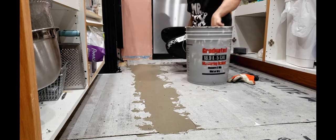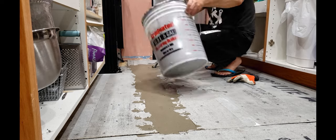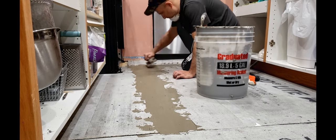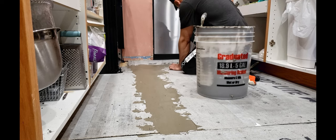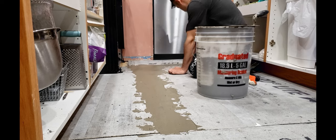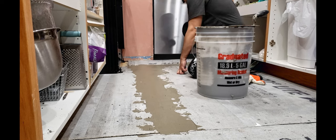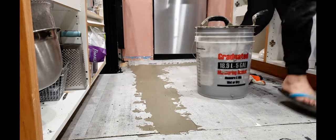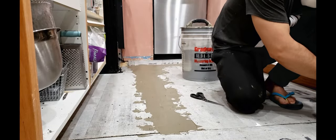Just to recap. Start by laying out your cement board, preferably in a brick pattern if possible. If not, use a pattern that would at least avoid all four joint corners meeting, as this will avoid any buckling when floors move. The reason you need cement board or a decoupling membrane is to avoid any tile cracking issues as the floor moves with weather changes and contracts and expands. This will ensure your tiles are moving with the cement board, hence your tiles will last for a long time.